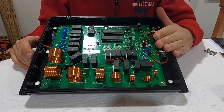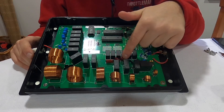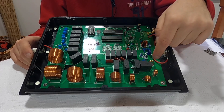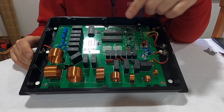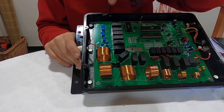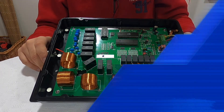This is a Pi-network tuner. On the input we have capacitors that are switched to the ground from the inlet. Then we have a series of one or more inductors in series. On the output we again have one or more capacitors switched to ground between the output and ground — this is a Pi-network circuit.